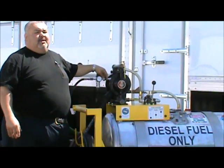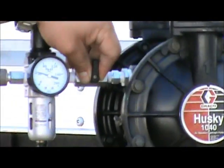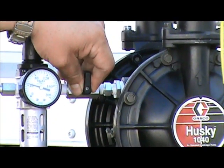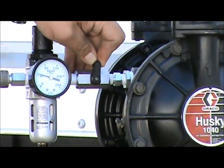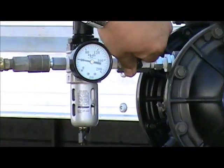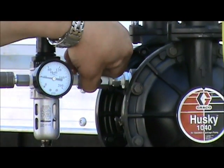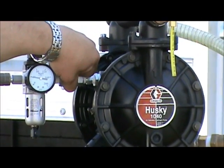To control the pump on and off, you have this control valve here. You can also control the amount of flow with the air shutoff valve, and then you can control the flow completely with the directional valve. I'm going to start up the air valve and gradually open it up.